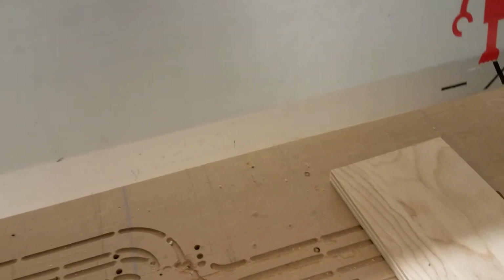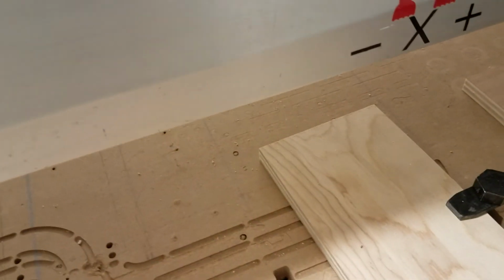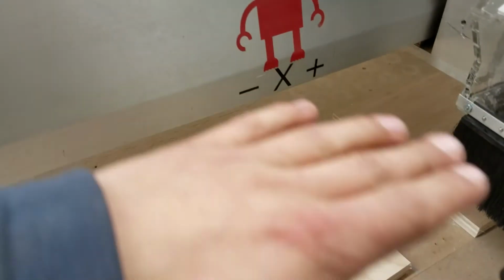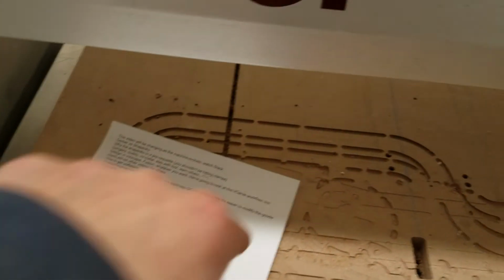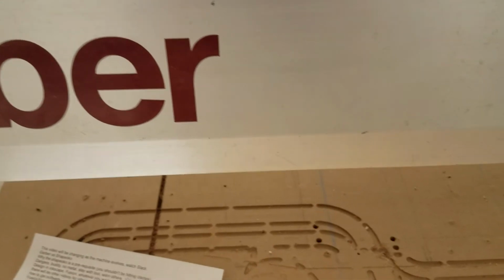And let's say you were doing a slab, like you had a slab of a tree that you were trying to flatten, then in general the vacuum probably is going to be very helpful for that. You'll have to clamp it down somehow. And in terms of touching off, you probably are going to, in VCarve, make a pattern that is effectively making a big pocket covering the whole area. And you'll say to take off 1/8 of an inch or something in a pass, and you'll touch off your Z on the highest point, and your X and Y, wherever you put your XY datum, on the top surface. And then you do that pass, and then you just touch off your Z again. You can increment down so that with each pass, you take off that material.